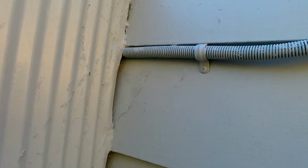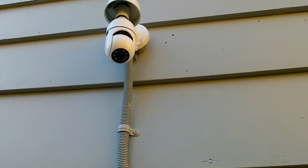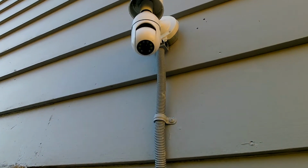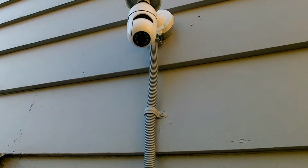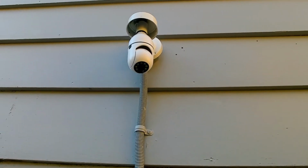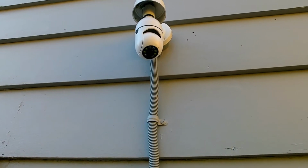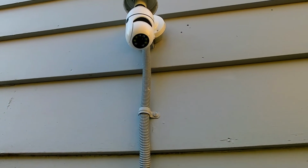The battery is connected to the inverter, which is connected to this conduit here, this flexible conduit. I've got 2 wires in there for a junction box, and I've put one of those screw-in remote cameras in there. It's really great. You don't have to run a special circuit. You could just, like a regular light circuit, outside light, you just screw these cameras in. Got the same Edison screw. It has a light in it and it has a camera, so that's kind of handy.